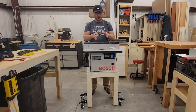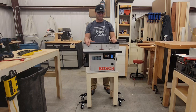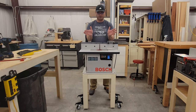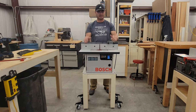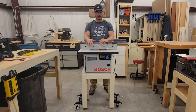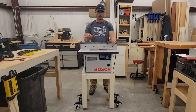We finally got the wheels situated and moved to the outside. Moving the casters to the outside increased our footprint for this router table stand, and I like that in terms of stability — it doesn't seem to have as much teetering and rocking. As with any wheel-caster configuration, if one is turned one way and another is turned straight, it does have a tendency to move a little bit. Remember, this stand is not meant to be used while the casters are engaged and fully functional for movement — lower it so you have a stable surface.